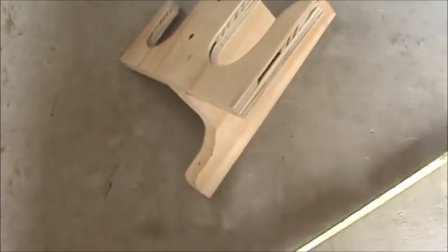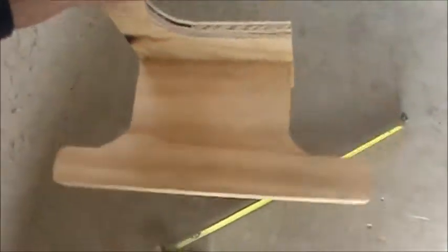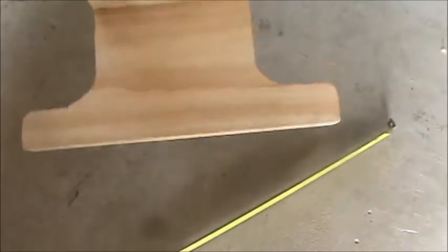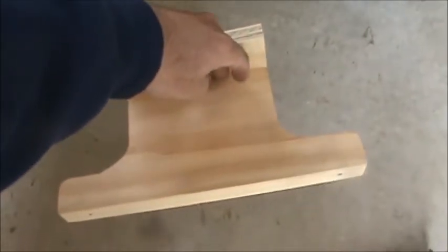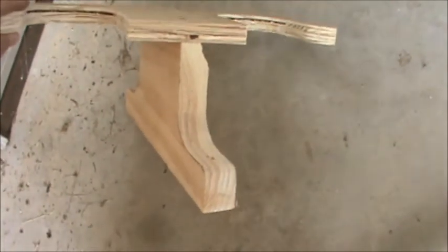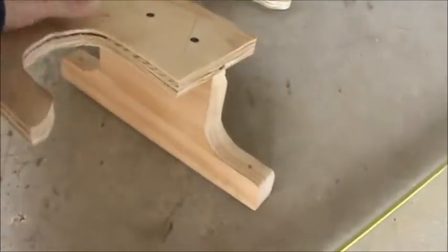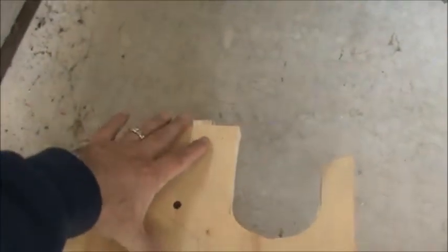I know people are going to ask, so I'll give you the dimensions. The bottom piece is a foot long from here to here. It is an inch thick, but the width from here to the end where my thumb is, up to the top, is six inches. And then I just cut like three-inch radii so I could put screws in. This thing is designed so that when you mount it on the wall with three-and-a-half-inch drywall screws, it goes right into one stud. So when you actually hang it up, you want to put it right on the stud, center it on there, and that will give you all the strength you need — whether you have drywall or not, it will mount right on a stud. And then this thing is six inches from there to there.